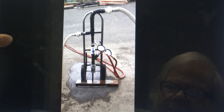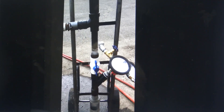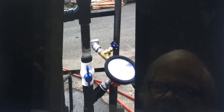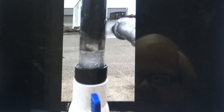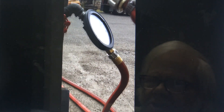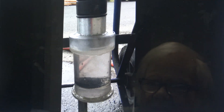All the material comes in and falls into the trap — the heavier materials — while all the lighter stuff, the sand, heads out through the pump and back into the barrel. Those are my flow meters there off to the right. You can see all the gravel spinning around in there, and also a piece of brass and a piece of copper in there too, kind of spinning around. You can see the air bubbles running up — a little malfunction. There's the elutriation water supporting the dirt, or the rocks in this case. And that is the collection jar where all the lead will accumulate, or gold if you're dredging with this.